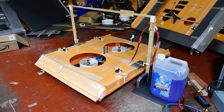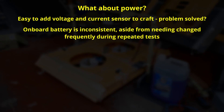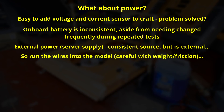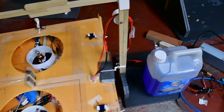With this we can measure height easily enough. Next problem is power, and this is like a sub-warren in the rabbit hole. The easiest thing is to use onboard telemetry — I've already got a voltage sensor and a current sensor, so I can simply record the power on the model as it's being tested. But running off a battery, as well as being annoying having to keep changing it, you're dealing with voltage sag issues, which makes it difficult to get consistent readings. I then realised I had to go to external power, and a quick way is to grab a DPS 600 PB and just plug it in. Except you've got to get the wire in without adding more weight and more friction. As anyone who hangs about RC groups knows, you extend the motor wires, not the battery wires — which leads to moving the ESCs outside of the model, having those on the power supply, and then extending the motor leads in, which is what is going on here.